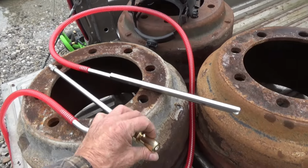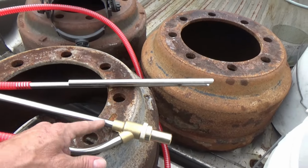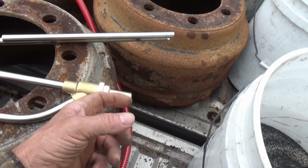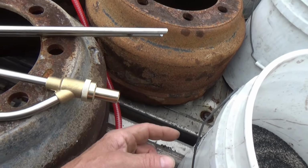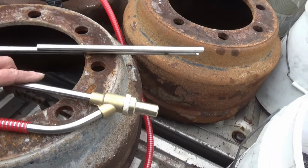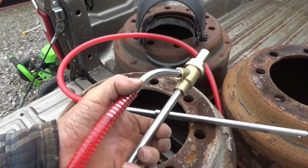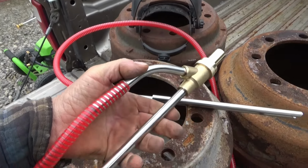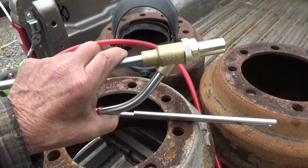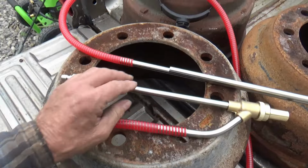But there's no air pressure on it, well, I guess in a way it does, because the water from the pressure washer is going to be going out at such a speed it's going to draw a vacuum from here. And I saw in other YouTube videos that they said you have to hold this siphon side up when you're using it, or water bleeds back into it and gets your sand wet, and then the sand clogs up and won't come out. So anyway, this is all set up.